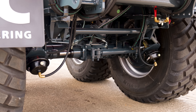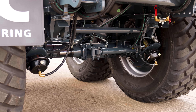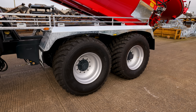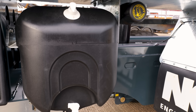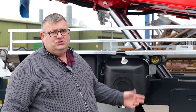It comes as standard with commercial axles. You have hydraulic over air braking, air load sensing, hydraulic load sensing, and a self-steer rear axle for manoeuvrability. Toolboxes on either side. We also have a small hand wash station — with a lot of these tankers, people are dealing with dirty hands, hooking hoses on, tying hoses, getting dirty.